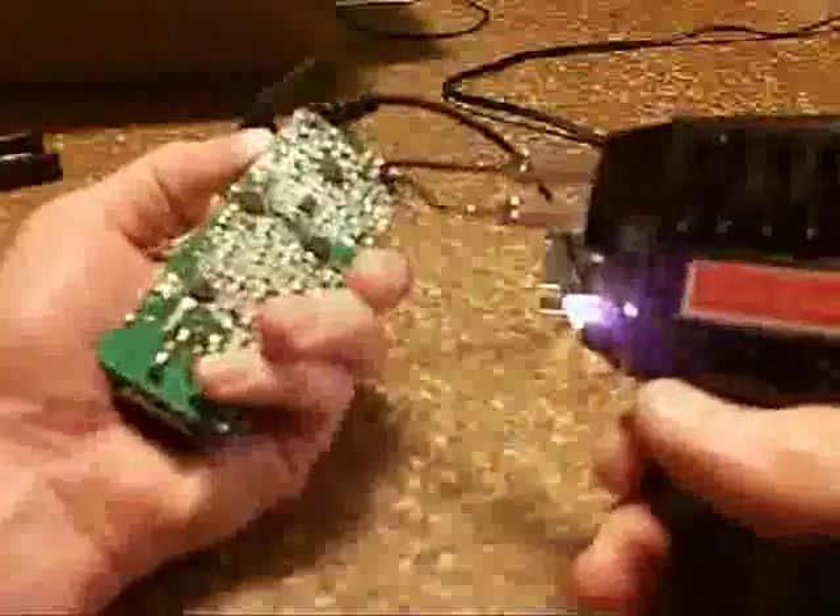Using a big soldering iron, but my little 15 watt soldering iron isn't heating up good anymore — that would have been better to use on that. Got that one out and working on the other one the same way, just doing it back and forth the opposite way where I'm heating it up and it gets it out of there. This one's a little bit tighter so I go and get that little pliers to help me pull it out as I heat it up.